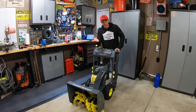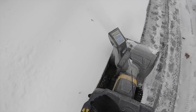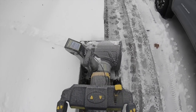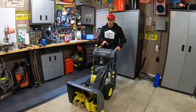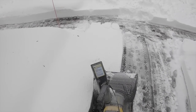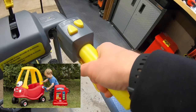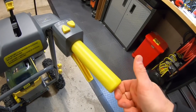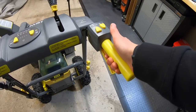The chute controls themselves took a little while to get used to. Unlike the gas model where you can adjust the chute while going down your path, this model requires you to set your chute first and then go — you cannot adjust it with the buttons while the machine is in motion. Only when you let go of the drive lever are you able to actually readjust the chute. That can get pretty annoying — let's say there's a giant tree in your way and you want to throw the snow around it; you've got to stop the machine, turn the chute, and then re-engage the drive. Lastly, holding on to this machine reminds me of holding on to a Fisher-Price toy. These handles are made of plastic and have a toy-like feel — my gloves actually slipped right off many times as I was trying to pull the machine back. This machine could benefit from rubber grips or at least a serrated texture for better grip.